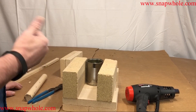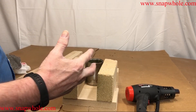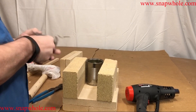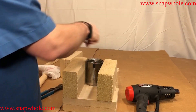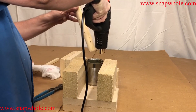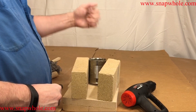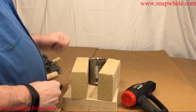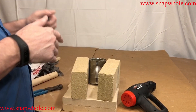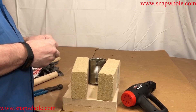I'm planning on building a plastic shredder for milk jugs. I think I'm better off melting this into chunks and shredding it into manageable pieces — this film is not very manageable. There's no way to get all the air out and have a solid structure. If I had milk jugs cut up into small pieces, I could drop them in, tamp it down, and fill the holes as I go. This film, on the other hand, doesn't compress well until it really melts, and by then it's too late to get it down in the cracks and crevices. I can just melt this and chip it up into chunks of plastic.